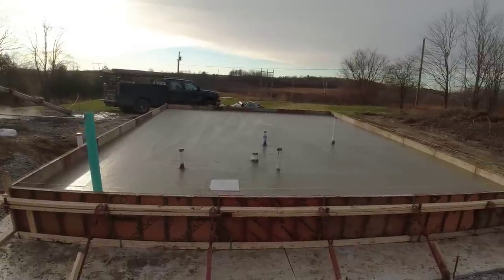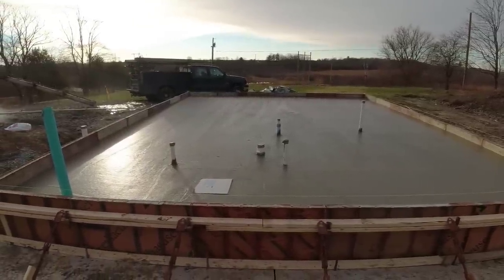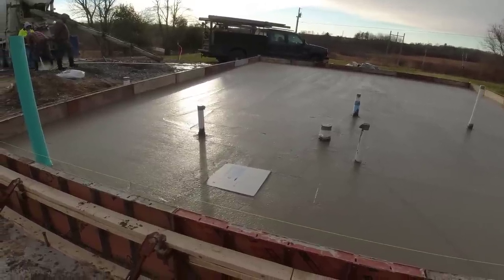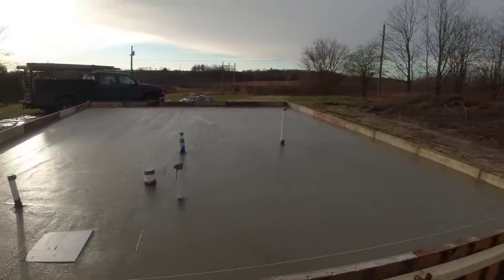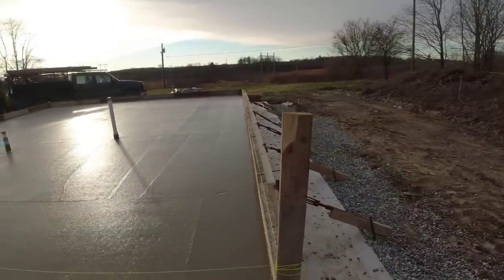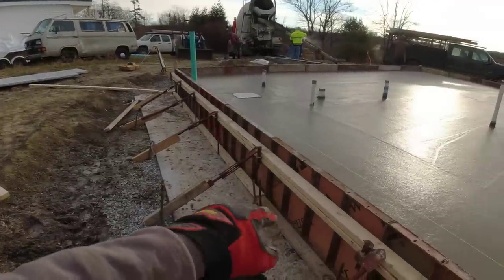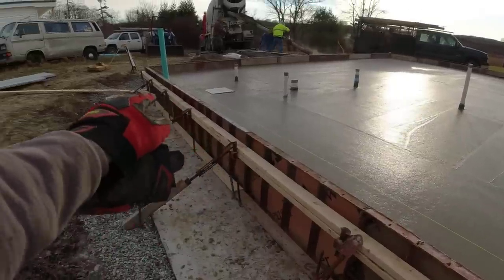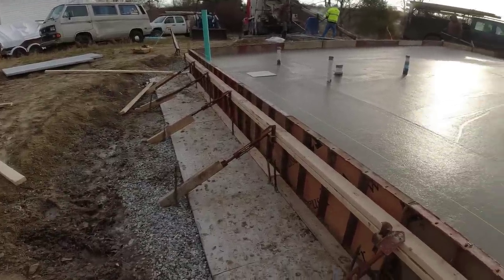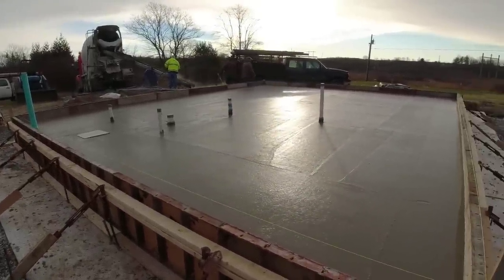We got 22 yards in that little thing — 11 yards just in the grade beam, the haunch, the thickened edge. The shower form was way too low so we had to add to the top of it. We had some plumbing going in too. Pretty small house, 30 by 24. The forms held pretty good, at least the tops did — nothing really moved, we didn't have to adjust anything. These guys use their two-foot wall panels with turnbuckles to stake them and keep them straight — a little different than how we do it, but it works and they held up good. That's all we care about. Another cold one in December. Thanks for watching — we'll see you on the next one.